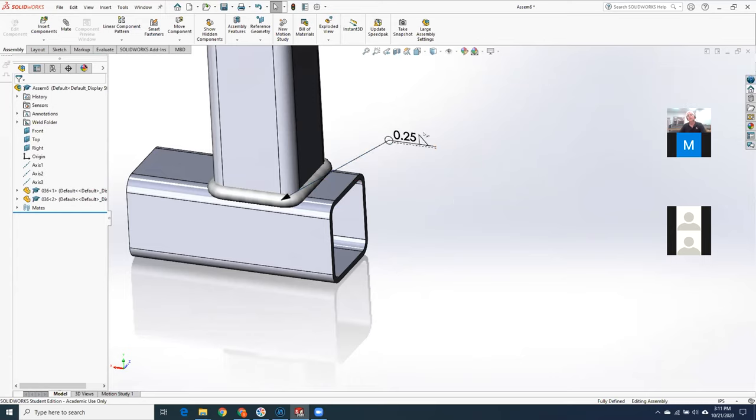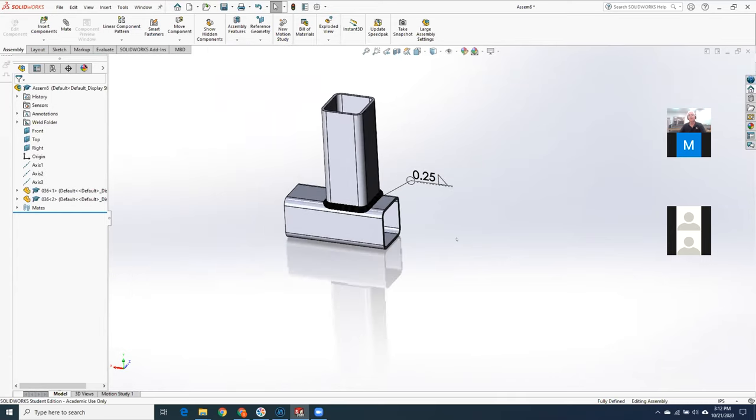Okay, but for some reason, my call out came out wrong. When you got the triangle up above, that means far side weld. That's equivalent to saying, I'm pointing here, but do the weld on the inside of the pipe. Well, if you guys ever ask a welder to reach down inside that pipe and do the weld inside, you're going to get some phone calls.